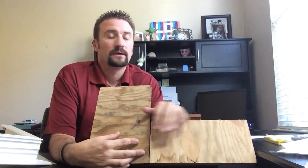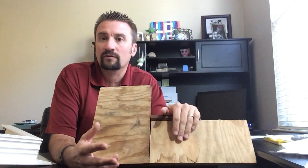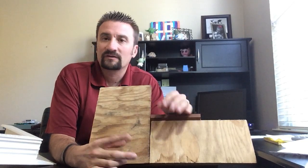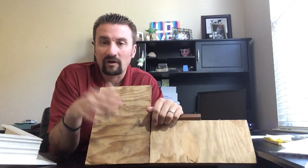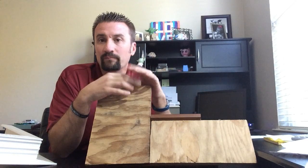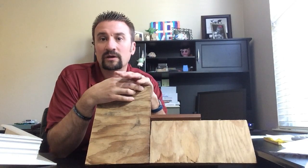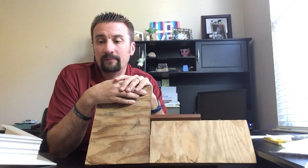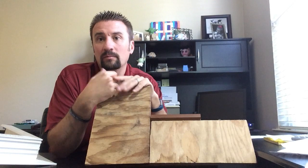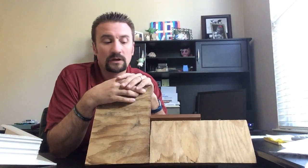One-story home, covered patio areas where there's not a water concern. But if you have a south-facing, west-facing wall with water that drives into the side, especially with a gable top, multiple windows, be thinking about this installation method, because we get a lot of calls from homeowners with leaky windows that think they have a water problem or a window problem, but they actually have a flashing issue.